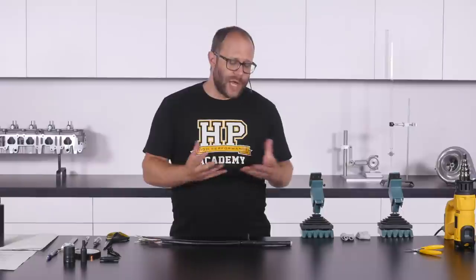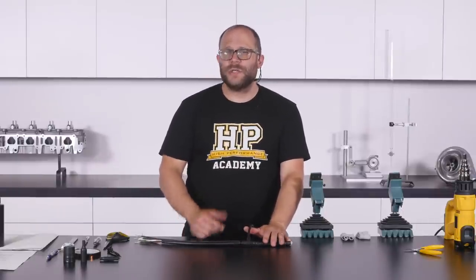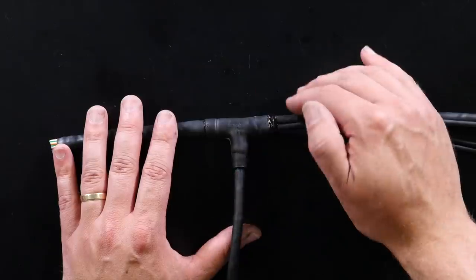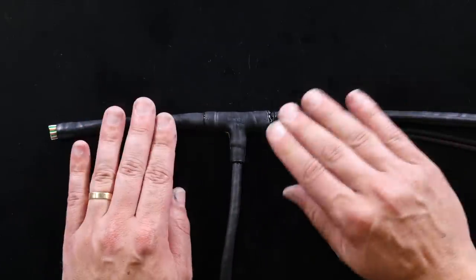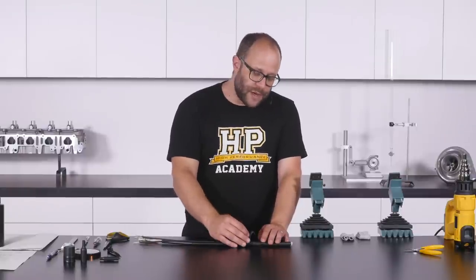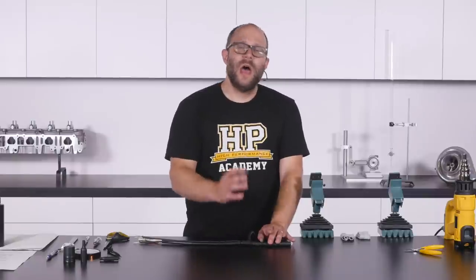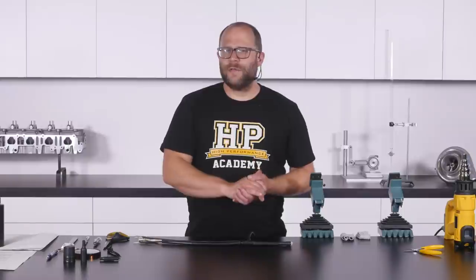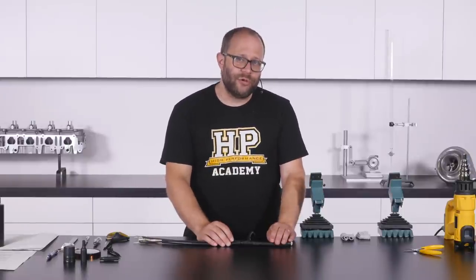With the molded shape recovered into place on the harness, do a quick visual inspection. Look for even recovery across the boot and a good even bead of sealing epoxy at each exit point. Often when recovering the boot, quite a lot of the sealing epoxy will squeeze out — in that instance, clean up the sealing bead using isopropyl alcohol sprayed onto a paper towel.